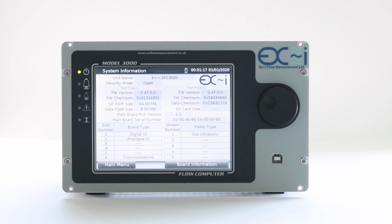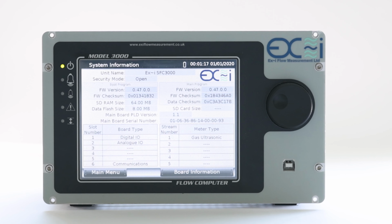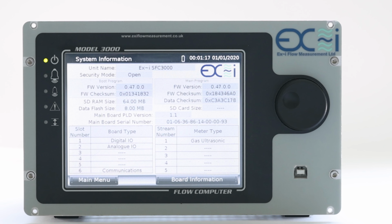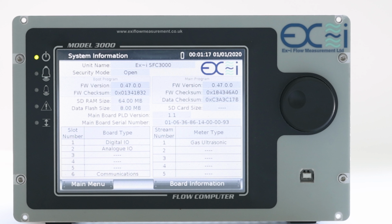There are two reasons why it may be necessary to change the firmware. Same as any software, bug fixes and feature or function changes. In video 5 we described what the four numbers that make up the firmware version mean. First is type, second is major, third is minor version, fourth fixes. So if a bug fix is being applied, it may be only the fourth number that changes. If the new firmware version changes any of the first three numbers, this will cause the configuration to be not loaded as the versions no longer match. Later we will see how to reload the saved configuration.